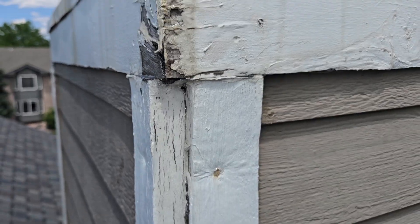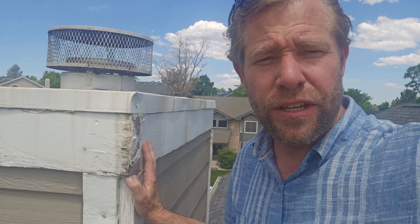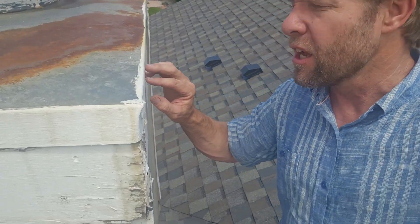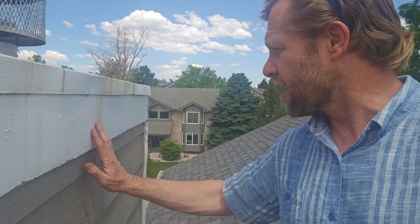Look at a visual scan down this. Do you see the signs of the water staining? The water staining tells a story. From our other videos, you know that soot tells a story, smoke tells a story. Up here as we investigate a water leak, water leaves a story behind. So we know that this is sheeting down and it's actually going on to this board.